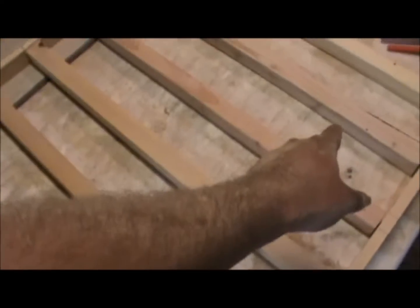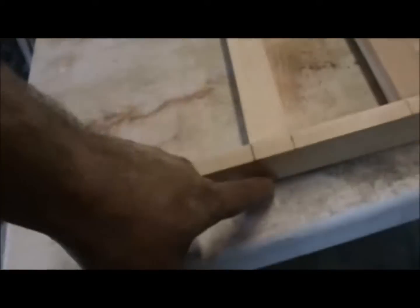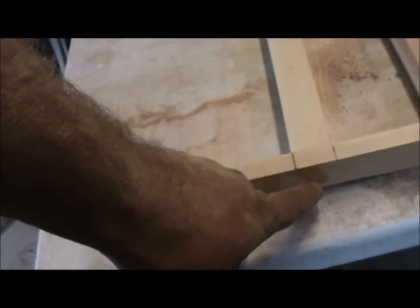Now, like I said, I've gotten one done. I wanted to show you the different pieces to it, though. I've got my balusters here, which have all been cut to length and sanded. Then I've got the rail that they attach to marked out. There's a 4-inch space between the balusters. Down here on this section, I pre-drill a hole and then sink a screw in to hold the balusters in place, and I do it on both strips up there.